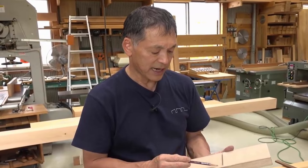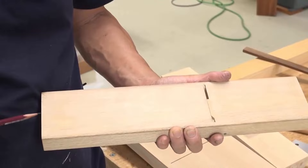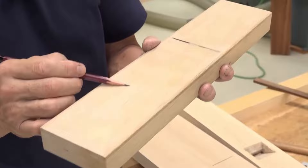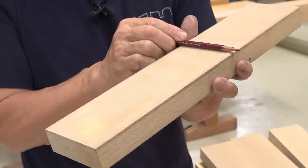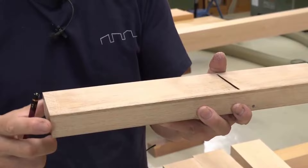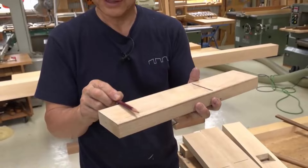As for the sole, to give it stability, I flatten 1 cm of the sole here, as well as about 1 cm towards the end of the body. If you want more stability, 2 cm would be fine also. The other areas should generally be made a hair's thickness lower. The flat areas towards the end and near the mouth must be parallel — if they aren't parallel, the plane will be unstable and the shavings will break. However, if those flattened areas are perfectly parallel and you take 30 to 40 microns off the area in between, the plane will work very well.